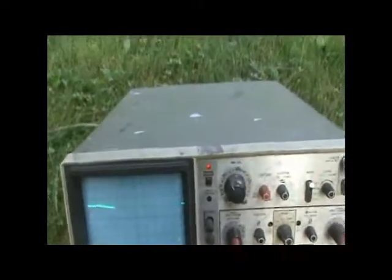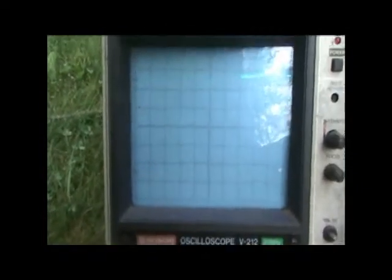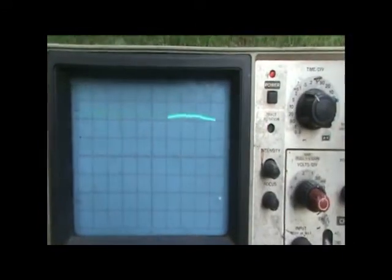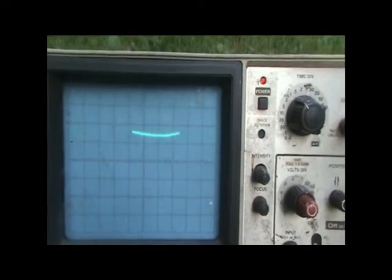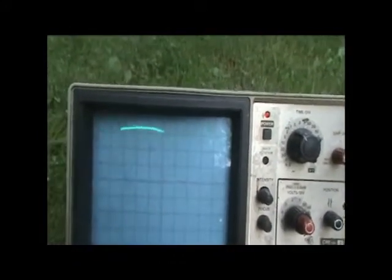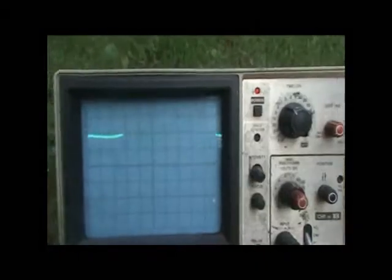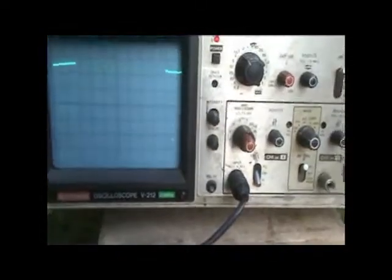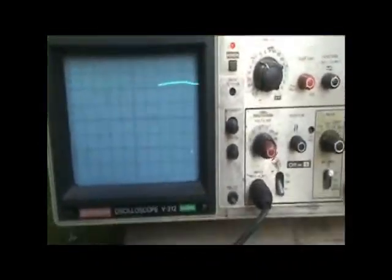We can also watch this on the oscilloscope. You'll see that the voltage corresponds to the striking, then slowly comes back down again. I thought at first perhaps it was just making better contact from the striking, but if that were the case, as soon as I stopped it would go straight back down — but it does not. Also, from the vibration of the striking, I would expect an AC component, but this is a DC component being produced, and it continues even after the striking is stopped.